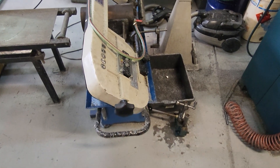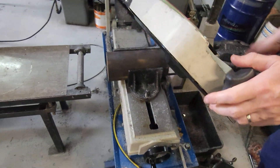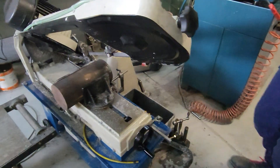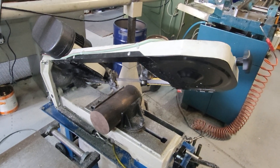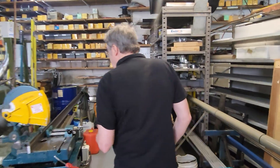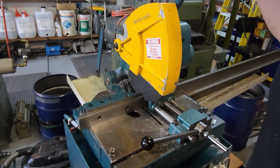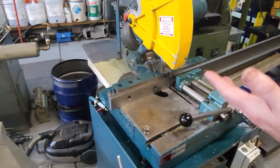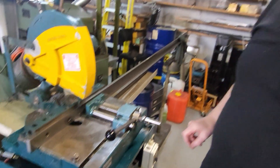You always need machines to cut your bar stock up. We've got an electric bandsaw here for cutting really big bar stock — like 150mm diameter. So if we're cutting blanks for the ring gears, which are made out of 90mm round high-tensile bar, we would do it in this. Or we've got our cold saw here, which is used to chop up smaller bar stock. Australian made as well.